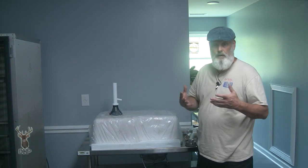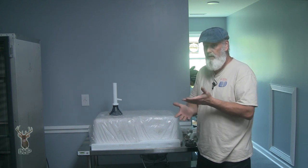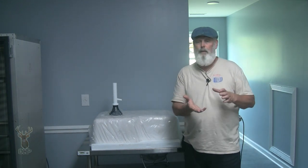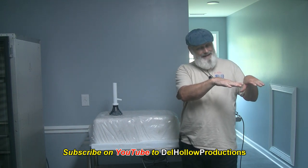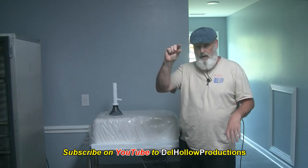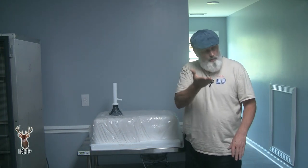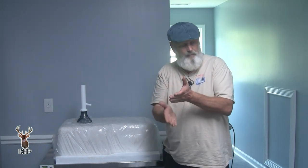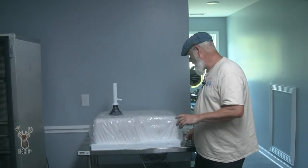What are my options to minimize that? First, I'd probably go top mount or underslung in the sink base. If you go top mount, you'll gain about an inch of thickness. You'll also have the ability to go a little deeper than a skirted or farmhouse-type sink, because you can go deeper than that front edge where you'd otherwise be cutting out the blank. Another option: using a low-profile strainer type brings the connection to only about two inches from the bottom, gaining two more inches of clearance.